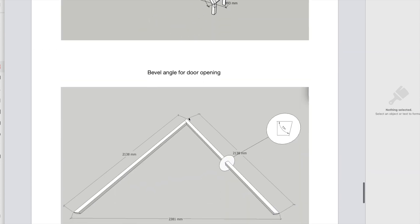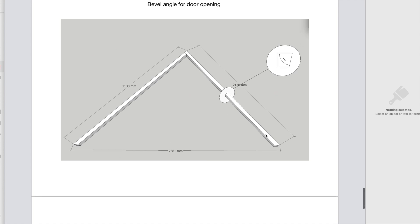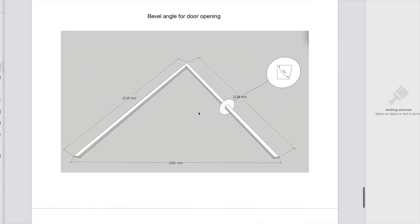This will just square everything. It's got that angle on it — 13 degrees on the saw. That then squares everything up so you can make your square triangle frame come out square. So you could build a porch on, you can join several domes together with this section. There's no chopping about — it's all easy to waterproof. Nice and simple and nice and easy.